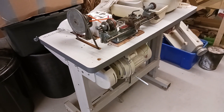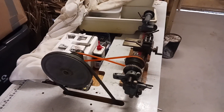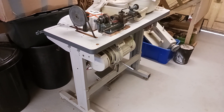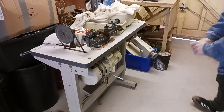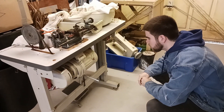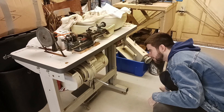I bolted it all up and then I realised the motor was going the wrong way — this was spinning up instead of down. I scratched my head for many days and eventually found the solution was to just twist the belt on itself. It's going to reduce the lifespan of the belt, but it works. It's not three-phase, just mains. With DC you'd just reverse the polarity, which is what I was expecting. But it's an AC motor where you have to physically remove the coils and flip them, which was way too hard. So I just twisted the belt and it's been working quite well.